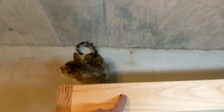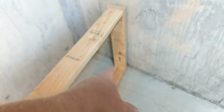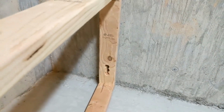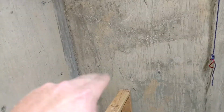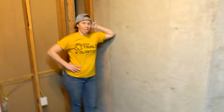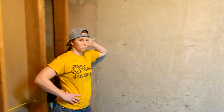And so we have some holes that we have drilled out in our piece for these concrete anchors that we will drill into the wall. And then we had to cut some slots into where it's going to anchor on the side here, so that we can manipulate the shelf, so we can push it onto the side and then slide the whole thing over the 4 bolts that'll be in this wall. Kind of a little bit of a funky way of doing it, but we have the concrete, so we might as well anchor it in and save some vertical supports.